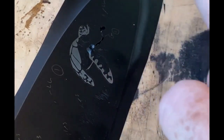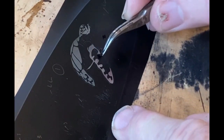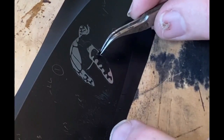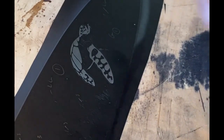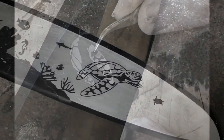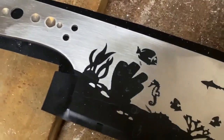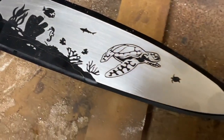This process doesn't take all that long if you spent enough time on the design to make it kind of a silhouette, so that most of the lines connect with other lines of similar color. That way, when you remove one, you're kind of removing them all. That really helps them hold up to the electro etching process. It doesn't take long and you get to the stage where you're ready for the first etching.